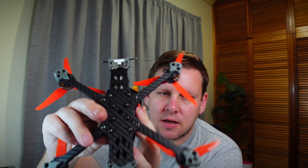I've just finished the build of the Foxeer Aura with the Reaper and the F722 and it's come up really nice. In terms of the frame and how it went together, the thing I didn't like was having to mount the Caddx Vista at the back with cable ties — I thought that was pretty average. I understand they're trying to be versatile for different use cases; the back can fit an air unit as well, and you'd get your analog VTX in a 30 by 30 or 20 by 20 in there. The stack height makes it quite a tall build — I'd prefer it slammed — but overall it's a pretty good build.